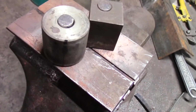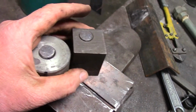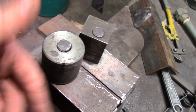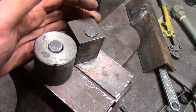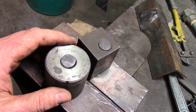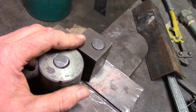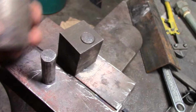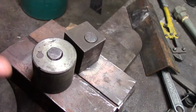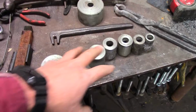We're going to fix this thing. Those of you that have been watching since I started posting will remember I built this last week. This was supposed to be my hook bending jig, and it failed horribly. The biggest failure: it was supposed to be adjustable, so it'd move in and out. We'd use these little dies from off the compact bender, the Harbor Freight bender. It has these two 5/8 pins. We riveted them to these two pieces of angle, and the idea was you'd slide them back and forth, and you could change to these different dies.